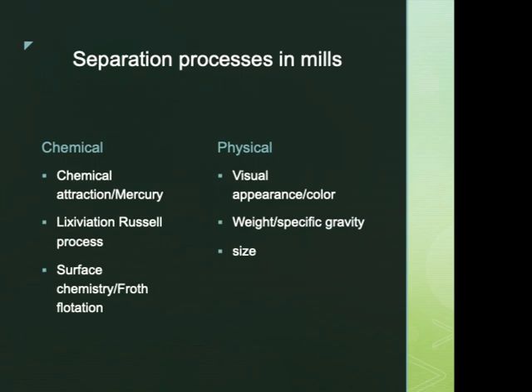Another chemical process in extensive use today is froth flotation. It was introduced in the 1920s and involves crushing the ore to a much finer size — think of face powder. The crushed ore is combined with water and surfactant chemicals in a large tank and air bubbles are passed through the slurry. Additional chemicals are added to selectively collect the metal ores, which are filtered and the filter cake shipped to the smelters. Froth flotation processes are still extensively used today. Physical processes, which dominated the industry from about 1890 onwards, involve separating ore from waste rock based on visual appearance, specific gravity differences, and size differences.